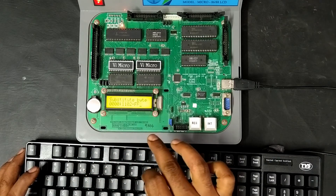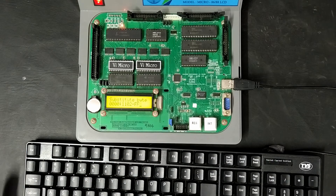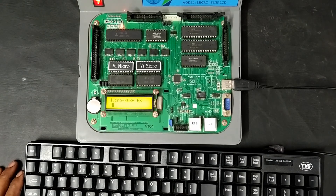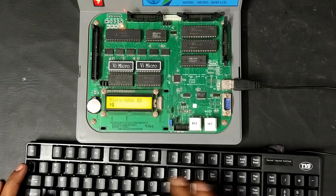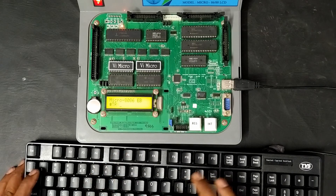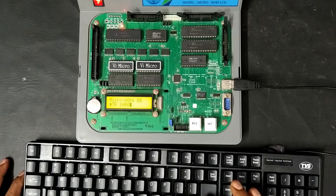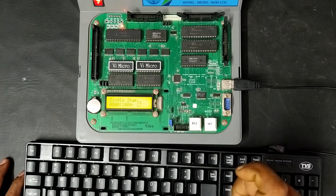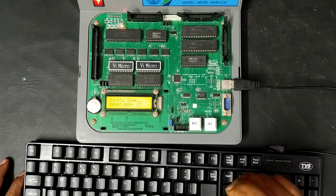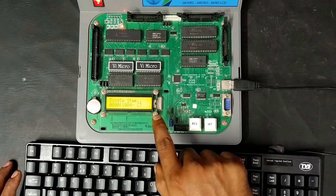To move from current execution back to reset mode, press the dot key. Then enter the TR command followed by starting address 1000. This is single-step execution. In the initial step, the first instruction — MOV AX, 1111H — is executed. We can then go and check the memory location to see whether the data is updated or not.